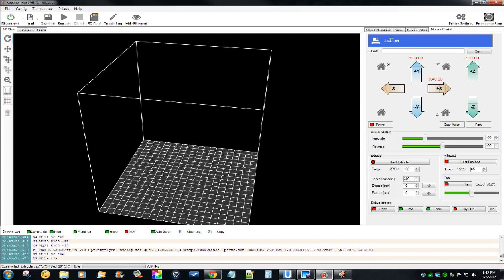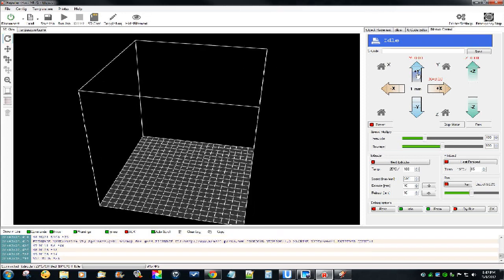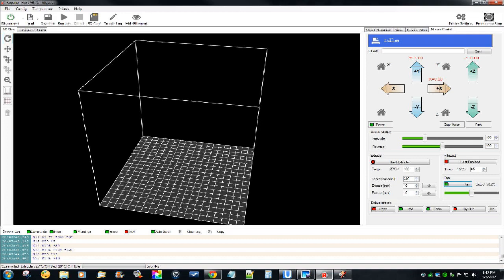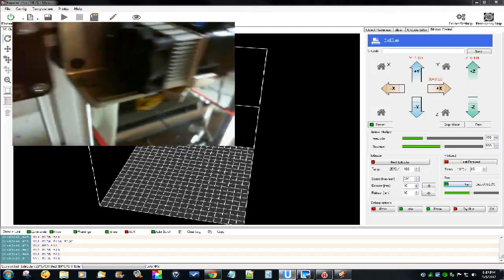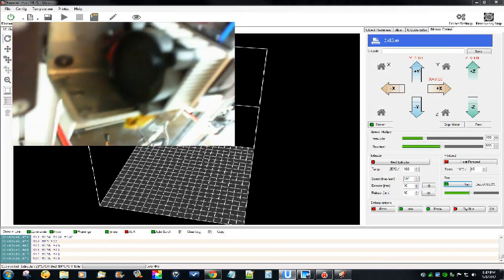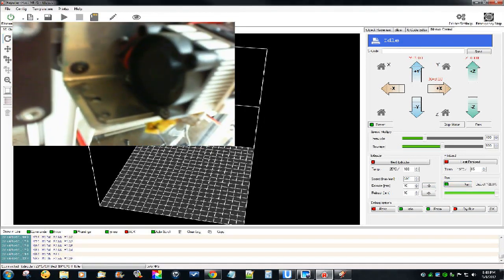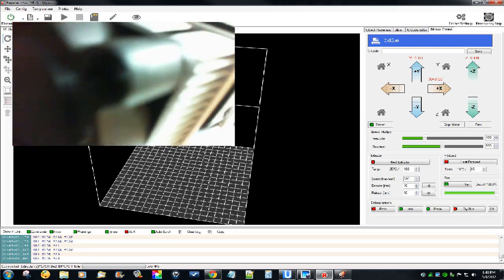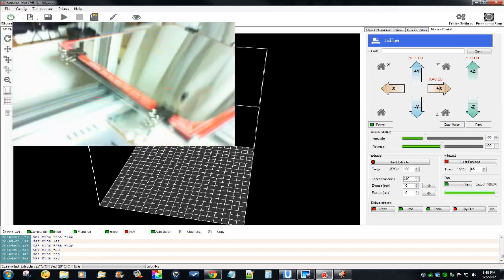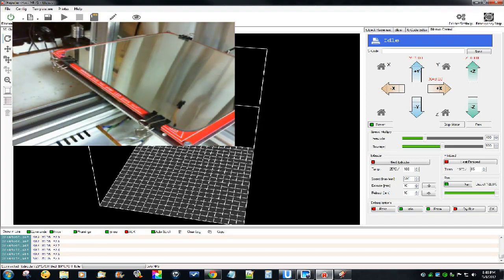You can see this little blue line around the outside edge - this is that skirt we were talking about, drawing two perimeter lines. No matter what shape the object is it will encompass it with a matching perimeter. Are you using PLA? I am using PLA with this, which is pretty hard to do with this MK7 extruder. Now let me go over to the last window - Manual Control. This is where you do all your jogging. Hit Connect and everything lights up and becomes active.